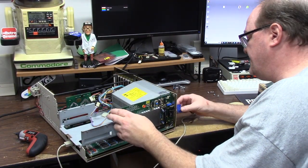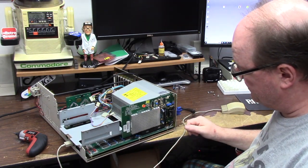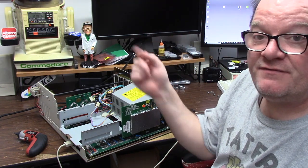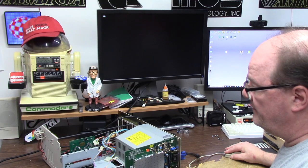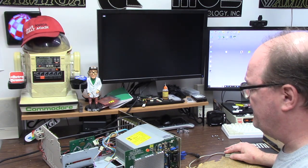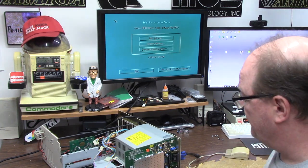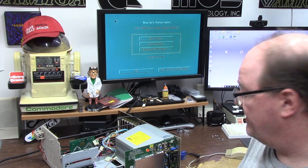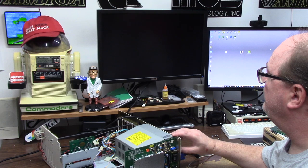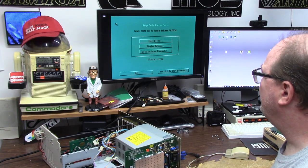Simply insert the card into the video slot and plug in your VGA monitor. It has two positions — I don't know which one is off or on, so we're just going to turn it on. It will still display at 15 kilohertz mode. Double mouse button — let's see what we get. So it's blue — bluer than anything. I'm going to hit the flicker fixer button. Still blue.